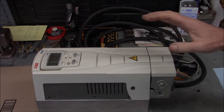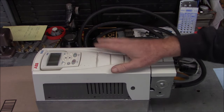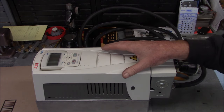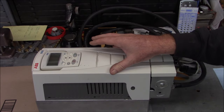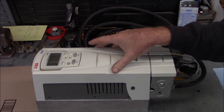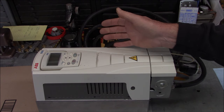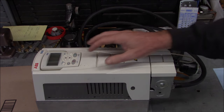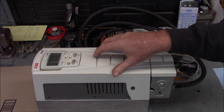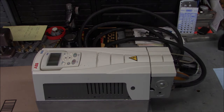The simplest way to control a VFD - and not this one in particular - is to just use the keypad. Probably the worst way to control a VFD is also to use the keypad. You have to fumble around to find the right button, and in a panic situation that could be bad. Here the off button is pretty clearly defined, but in a panic situation having just a regular switch or a kill switch is so much better.